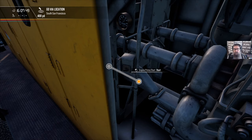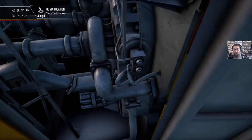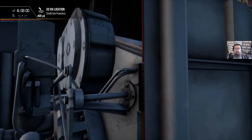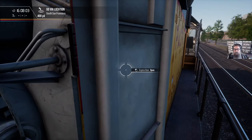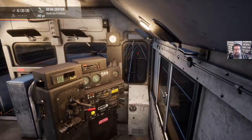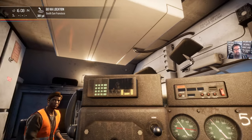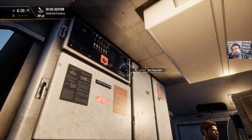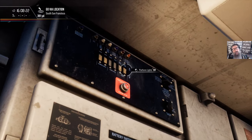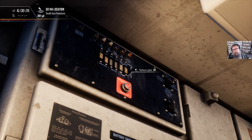Starting up the engine now. At this point you'd do a whole lot of other checks because all of these push buttons and things around the place — you'd be wanting to look for water leak indicators, over and under pressure indicators, oil pressure, all those sorts of things. Let's come back into the cab now that we've started up. We now have a running engine. First things first — let's put the engine run switch into run and we need to make sure there's no lights on up there, no indicators of anything that's wrong.